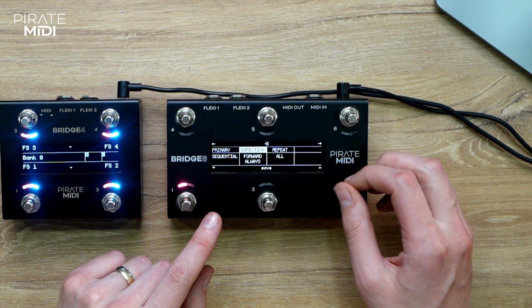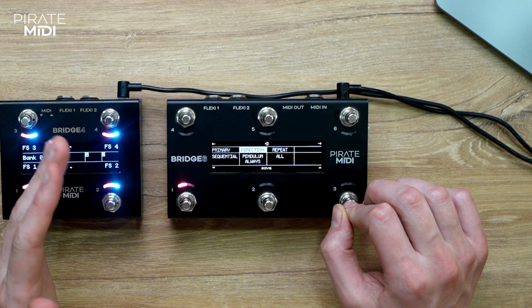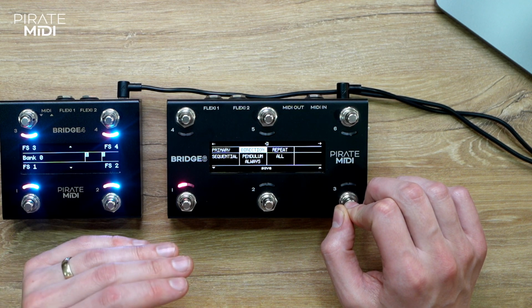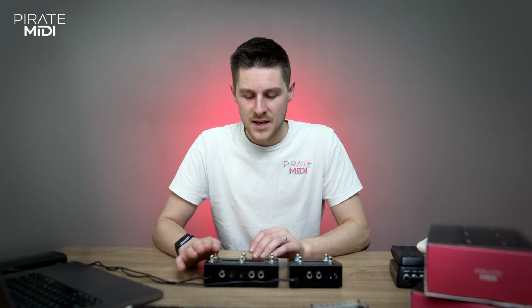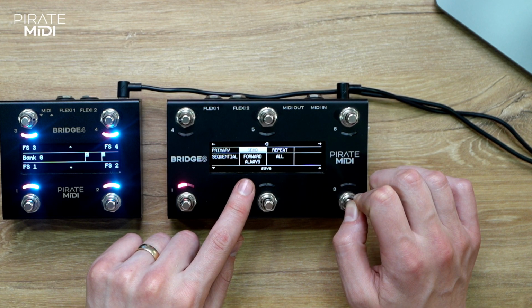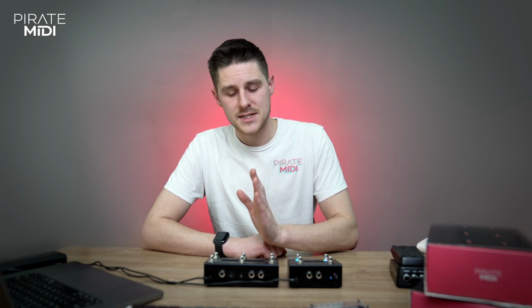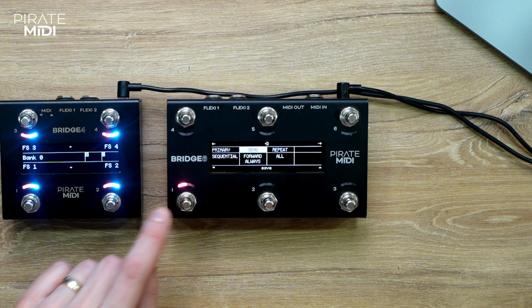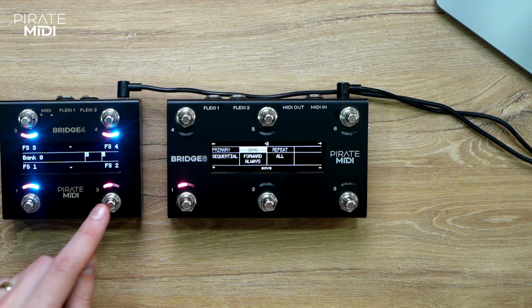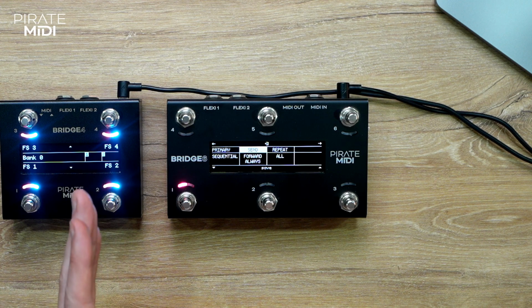Now these settings here for the direction allow you to choose this switch to go through that stack in reverse or forwards, or pendulum, which goes from the start to the end and then will reverse back through each of those steps. The send command, which here we have for always or secondary or primary, means that the sequential message can actually be delayed, so you can search for a step and then send it using the secondary function, which on this switch is a hold. So the sequential message wouldn't actually be sent until you do that secondary action.